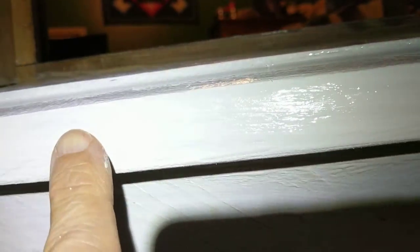Previously when I had put borate rods into the side of the sill, I used wood putty — wood dough — to fill those holes, and that was not a durable repair. That putty pushed out after several years. So this time I filled the holes with the epoxy filler and I believe that will be more durable.